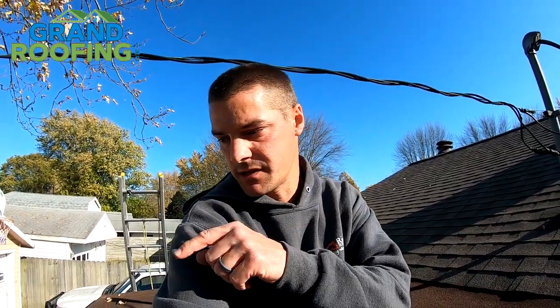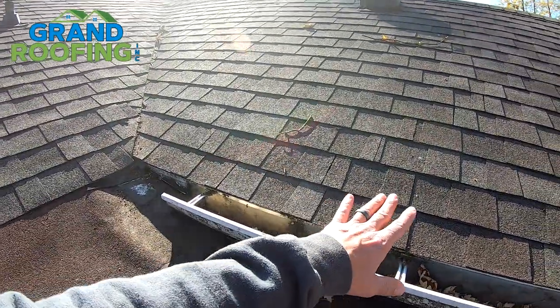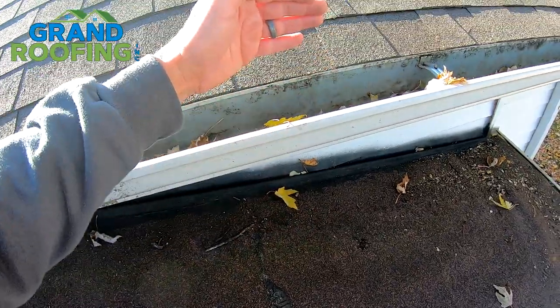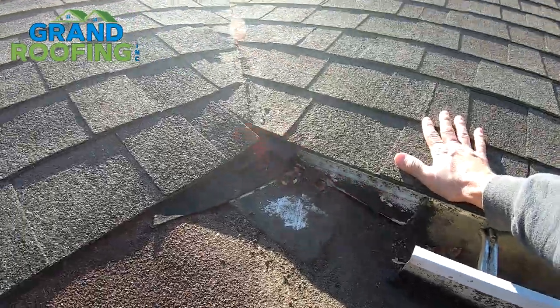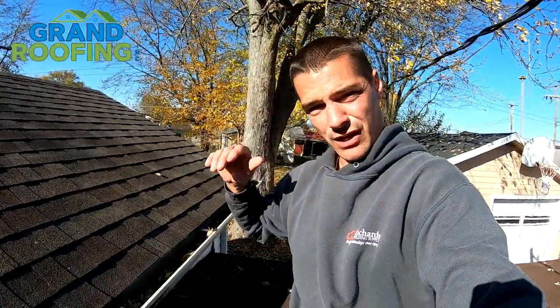Now let's learn from this bad situation. What I would have done with this material — aside from the primer on the bottom — is I would have removed this edge of the gutter section, used quarter-inch zip screws to zip it out, removed the flat bar and the shingles about two to three rows up through the valley and across. Then take your roll roofing, pass it down over the edge, cut into the corner and bring it up the wall all the way under the edge metal — same on the second and third pass. Get it all the way up under your fascia metal, under your gutter, up to your roof deck. Put your fascia back, put your edge metal back, then shingle it. You're after making a solid trough of this material coming all the way up under the valley section. Instead of relying on spray seal, Flex Seal, or tar — they're all going to give, they're not going to hold up — if you make a solid trough all the way down, it would carry the water all the way out.